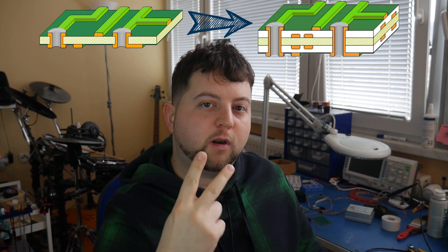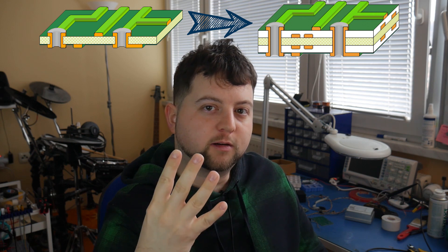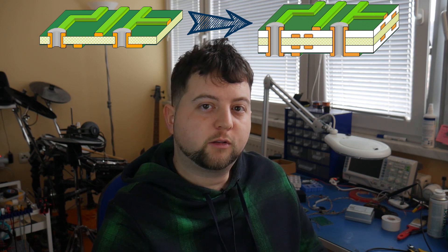Why hello again. As for my absence for the past few months, I've been quite busy designing and testing the new PCB. It took me longer than I anticipated due to some design corrections and changing from a two-layer board design to a four-layer in order to reduce the electromagnetic interference and make it more industry compatible.